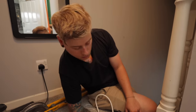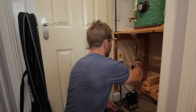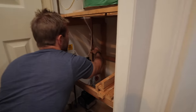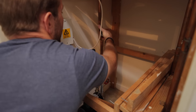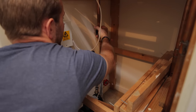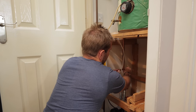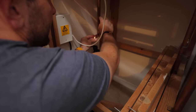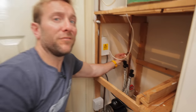I thought we'd only need two 22mm elbows but having a look at it we're going to have to do a little bit more. We're going to cut into this down pipe here — cut it out like that. It's going to keep dripping a little bit. This piece is going to just do that, then we'll cut up here, put a straight coupling in, and set over to here using the bending methods I've taught you in many Plumber Parts videos.